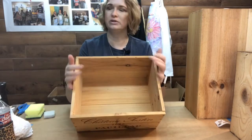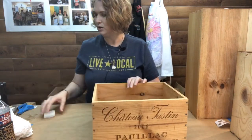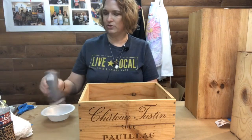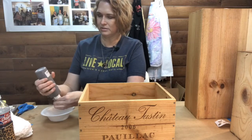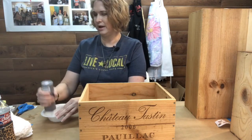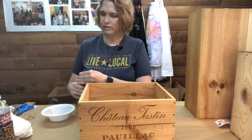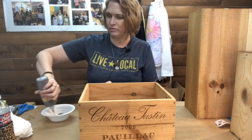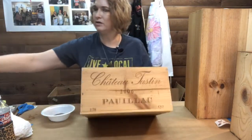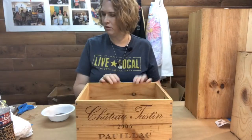What we're going to do on this one is stain it with the Voodoo gel stain. This is a water-based stain, so once you're done staining and it dries — probably about 30 minutes to an hour — you're ready to go on to your next project. If you've used oil-based stain before, you know that's quite messy; this is not the case. This is very easy. We're doing Tobacco Road — I want a nice brown color because I want them to look a little older, like they've been around for a while.